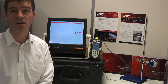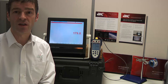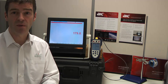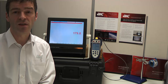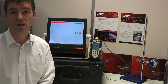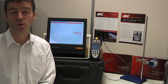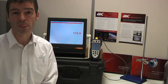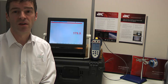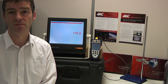The alternative method, which is recommended, is to carry out an in-situ calibration, where you actually take the machine up to its operating condition with a reference standard next to it, completely independent, and compare the readings using that method. Failing that, the only alternative is to replace the cable. On some machines that may be the most cost-effective way of doing it, but for many autoclaves and ovens with dozens and dozens of thermocouple cables installed, the cost would be prohibitive. But an in-situ calibration, provided you know that all of the batches of thermocouples are the same and they've seen the same cycling, ought to provide good assurance that your measurements are indeed accurate.